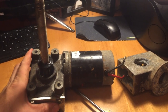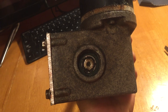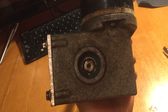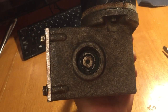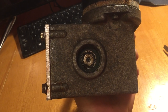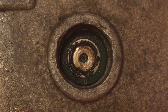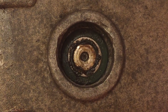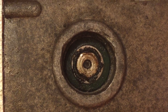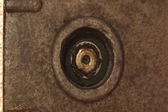The process to replace these bearings is actually quite simple. You're going to start by finding a freeze plug in here and popping that freeze plug out. If you ruin it, don't worry — take it down to your auto parts store. Advanced Auto and AutoZone actually stock these in their miscellaneous section. You pop that freeze plug out and you can see the shaft sitting in the middle of the bearing. You just want to put a pick or something on that shaft that you can hit with a hammer — it could honestly be an old screwdriver — and pop that shaft out through that bearing.